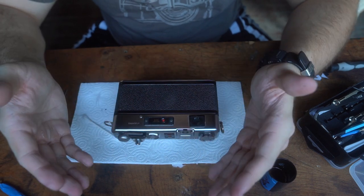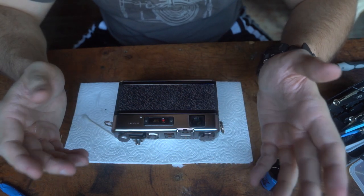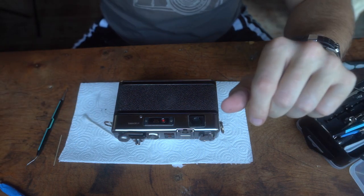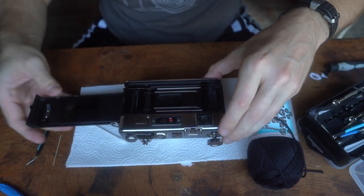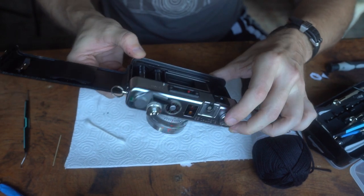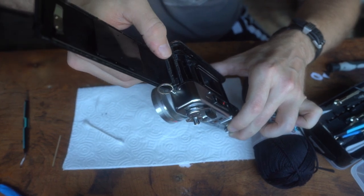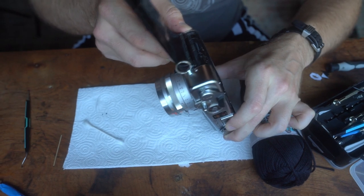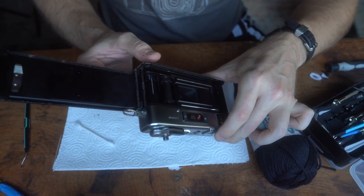The light seals I do are more or less permanent. A lot of old cameras have foam that turns gunky — very slimy, sticky, no good, gets everywhere, and eventually disintegrates. I use 100% cotton yarn for the track seals and felt everywhere else there's foam. I'm going to clean off all the old foam with 99% isopropyl alcohol, scrape it off really well, clean the inside of the tracks, and then replace them. When you do it this way you shouldn't have to replace the light seals for the life of the camera.